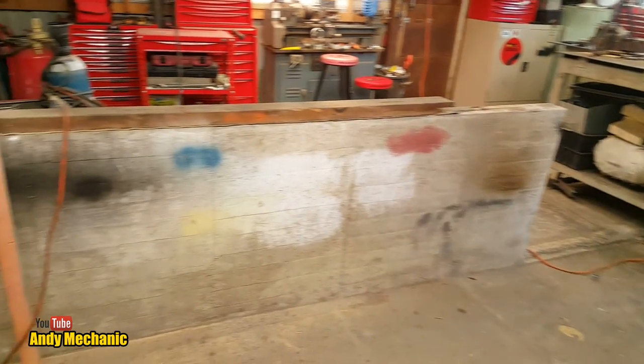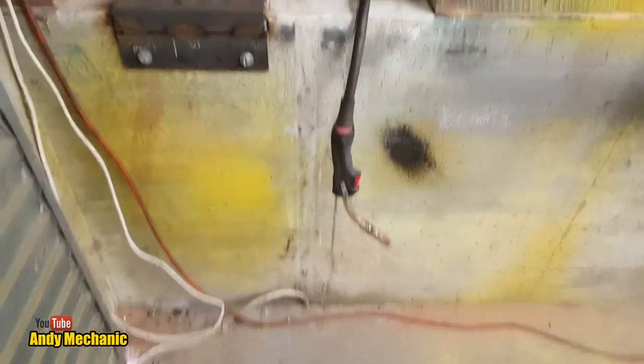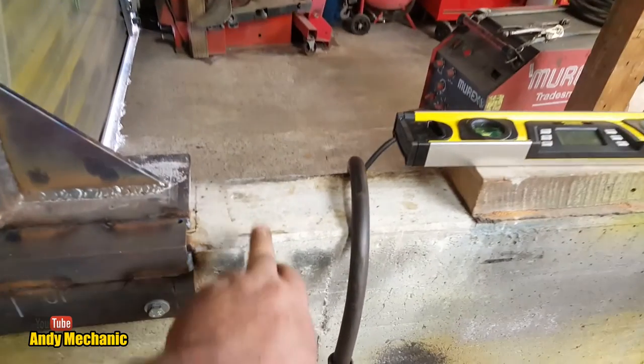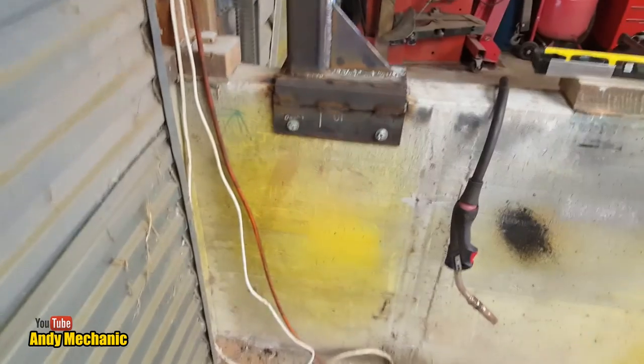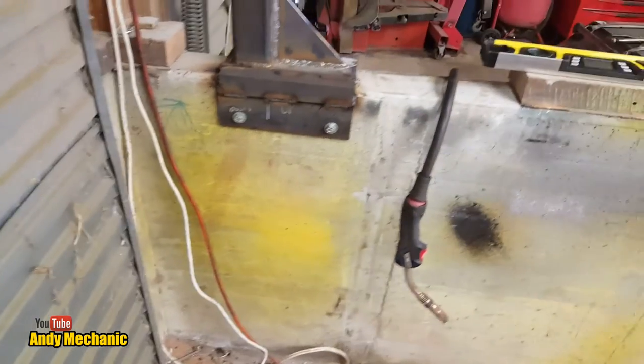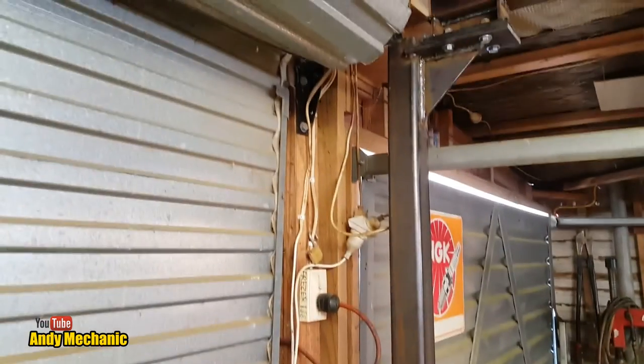But once that's gone, that's been the wall, and obviously I will only cut the wall out up to about here. We'll leave a little bit of a stump still there, but that's okay, because that's going to support the timber that holds all the doors and that kind of stuff. That timber's not supporting the roof anymore, by the way.